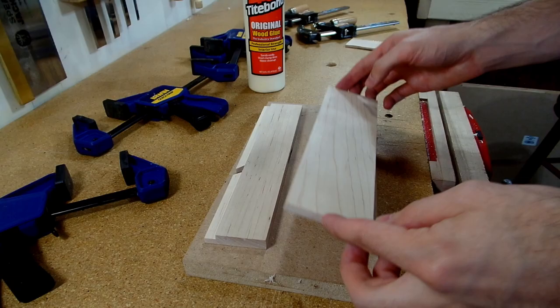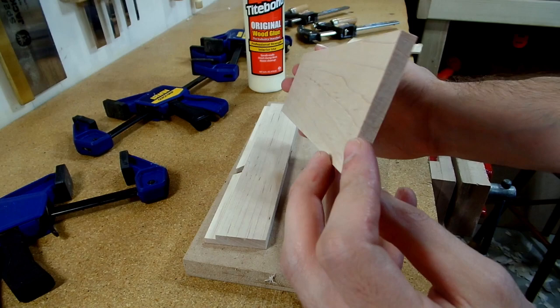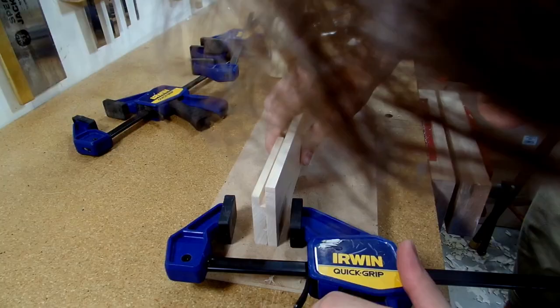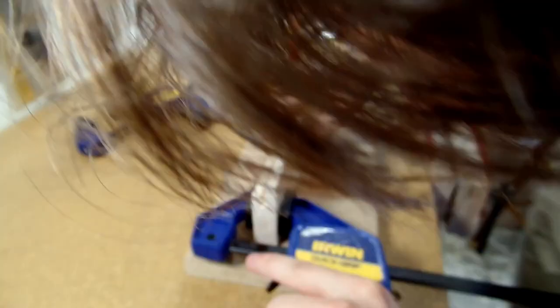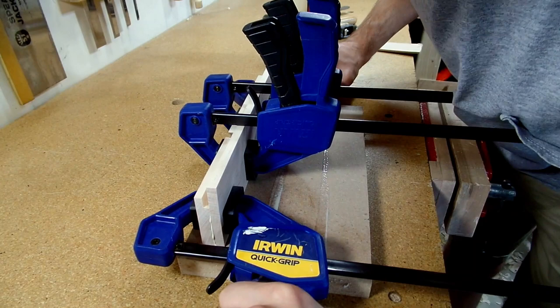Now it's finally time to glue the fence and the body of the plane together. Off camera, I planed down this piece of quarter inch maple. All I had to do was spread some glue, line up the edges, and clamp it on. One key thing to notice as I'm spreading the glue is that I'm leaving a good quarter inch of space between the glue and the bottom edge of the plane — I didn't want any glue squeezing out into the open groove and chunking it all out, which will make cleaning up way easier after the glue is dried. I initially used all the clamps I had to glue it together, then after about 10 minutes I removed the clamps and placed the whole thing into my vise to really clamp everything together.